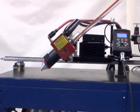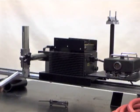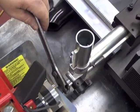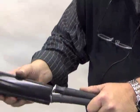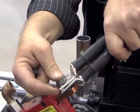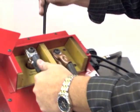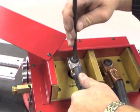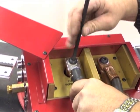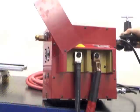Now let's set up the torch head. These connections run from the control box to the torch head. First, mount the torch head using the mounting hardware supplied with the N7500 package. Feed the DC power cables through the black rubber cable boot and connect the DC power cables to the torch head bus bar, and connect the opposite ends to the bus bar terminal on the backside of the control box labeled Power Supply Out. These connections must be wrenched tight to avoid overheating the connection. Once secure, be sure to slide the cable boot over the bus bar on the torch head.